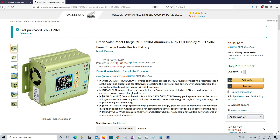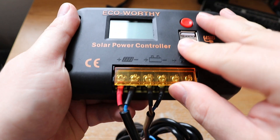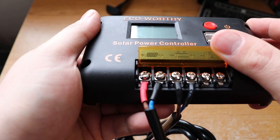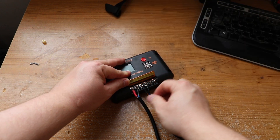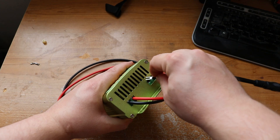I've found a relatively inexpensive boost converter with reasonable reviews, though keep in mind that this one cannot charge anything rated lower than its input voltage. Swapping out the new solar charger with the old one is straightforward. The standard method for wiring connection seems to be screw terminals. You just loosen the screw as needed to release the wire, detach the positive and negative wires from the old solar charge controller, and connect them to the new one.